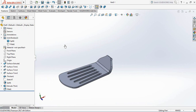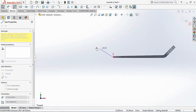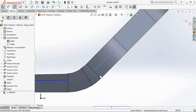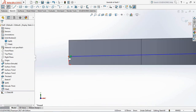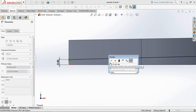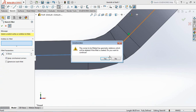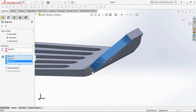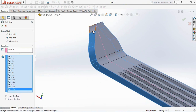Next, we create a parting line. On the front plane, select sketch. Create a line on the side of the spatula. Set the tip height of the spatula to 0.5mm, with an angle of inclination of 1 degree. Set the radius at 6.5mm. OK and exit sketch. Select Split Line on the feature toolbar. Click the sides of the parting line position. OK.